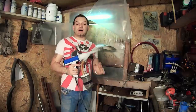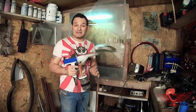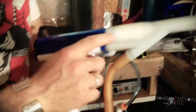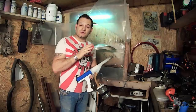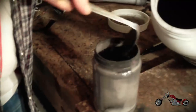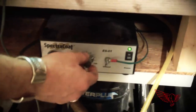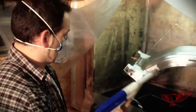Let's start applying the powder — here's how it works. The part is connected to the electrical ground and charged negatively. The powder held in this hopper is driven by compressed air through a tube where it is charged positively up to 100,000 volts. Once the powder reaches the fender, since the two are charged with opposite polarities, they attract and the paint gets evenly distributed on the metallic surface. All you need to do is create a powder cloud around the part to build an increasingly thick layer of powder.